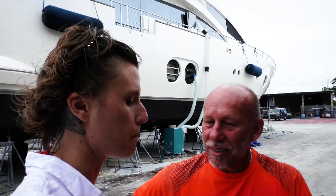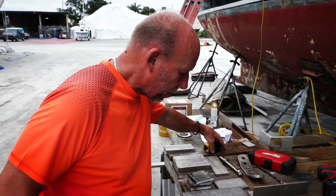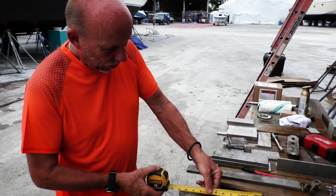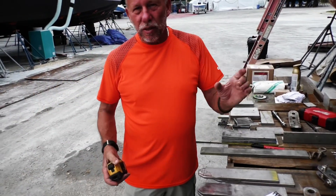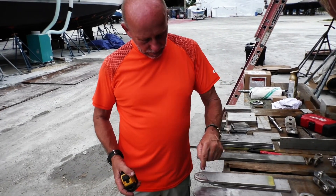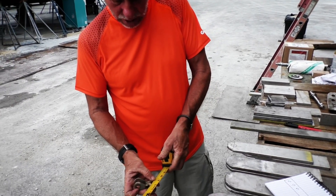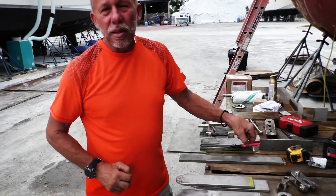But how would you design all of it? How would you make all of this? All you have to do is make a pattern of your current chain plate. You're going to have to remove it, or at least make a complete pattern by laying a piece of paper, trace it around, and take your tape measure and measure your current chain plate. What's the width? In this case it's two and a half inches. What is your total length? You take something round and make a radius. Measure the hole that your turnbuckle is going to be utilized, and send it off for quotes to a couple of machine shops. That sounds relatively easy — I think I can do that.